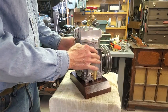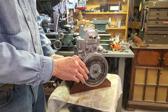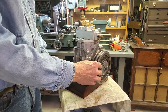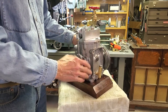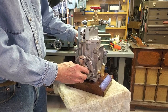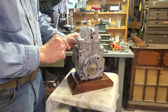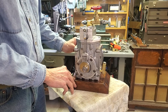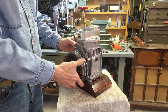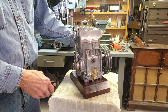So this is the body of the compressor — the crankcase. This pulley assembly that I'm using for a flywheel is what drove the compressor in the car; it had a magnetic clutch in there. The crankshaft didn't extend out of this side of the crankcase, so I extended the crankshaft so I could put this eccentric on there that drives the spool valve inside here, which distributes the air and the exhaust from the steam inlet. I don't even have a boiler big enough to drive this, but to demonstrate it now I'm just going to run it on air and let you see what it looks like.